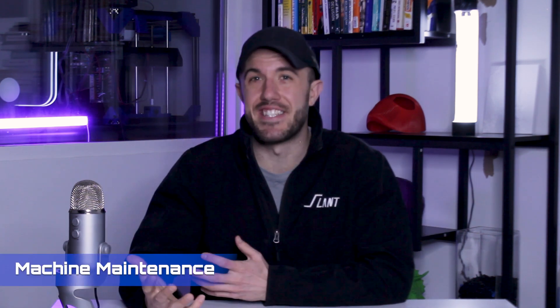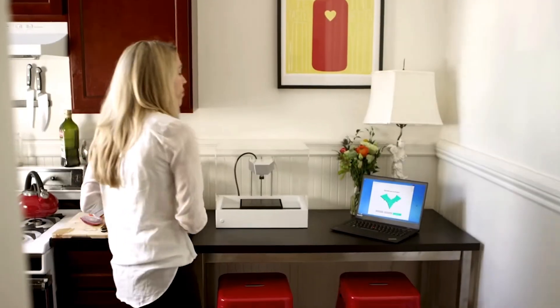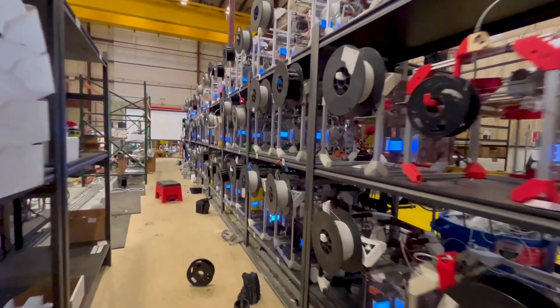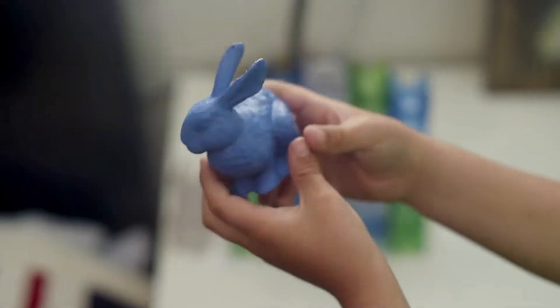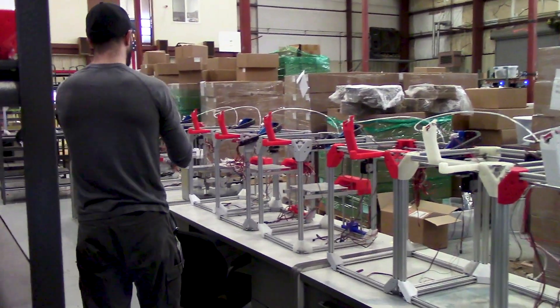The number one issue you're going to run into if you pursue mass production 3D printing or a print farm yourself is just the maintenance of the machines. Most people make the very fundamental mistake of just pulling machines off the rack and saying, 'I've got 50 machines on the shelf, I now have a print farm, I'm ready to go.' What they do not realize is that machines off the shelf are not designed for print farms. They are designed for an individual in a garage with one or two machines who uses them intermittently — printing a part a week or a part a day. If you are running a print farm, in order to meet costs, you have to have machines running continuously. This is the reason Slant 3D had to develop our own machines in-house.